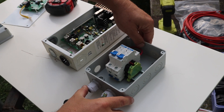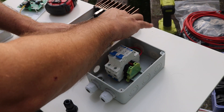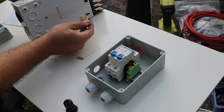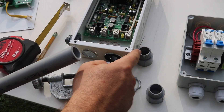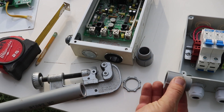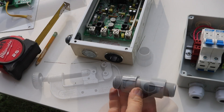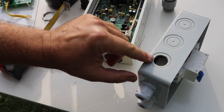In terms of alignment I'm just going to align these two holes and align this with the top — that puts all my parts right about here. Then I have to put a couple of screws into the board from the back. I'm going to make a very short piece of conduit between these two boxes with a threaded to smooth female end — I'll just cut a piece of pipe real short here. This needs to be one size bigger.